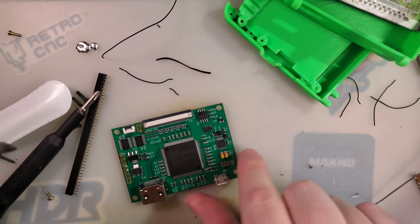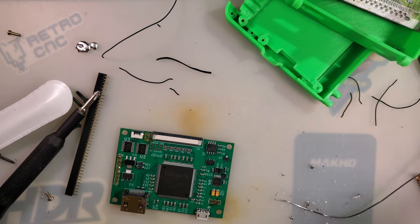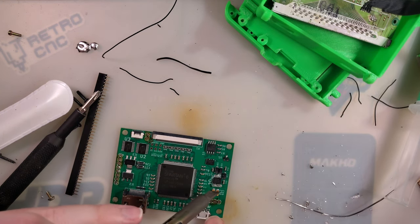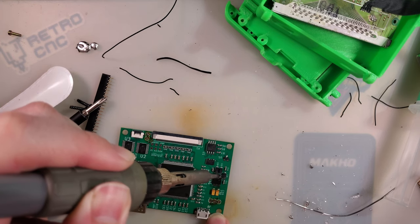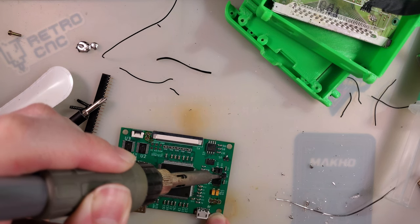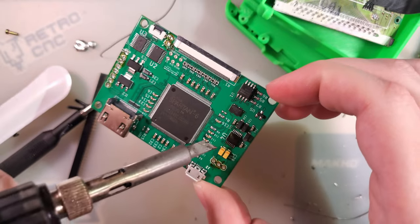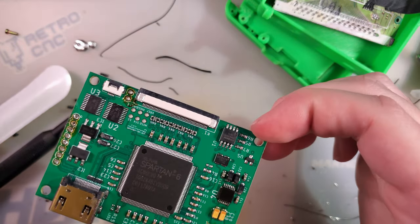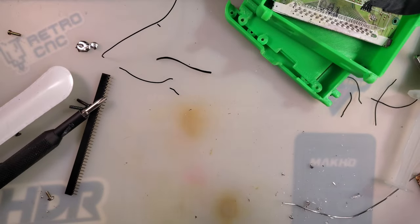And while we're in here, I don't know what's going on, but the solder joints on this component look really suspicious, so I'm gonna fix that while I'm in here. Just load that up with some fresh flux. Yeah, I don't know if that was like a mod or something, but that was real weird. It's all cleaned up now, though. Not the best way to burn off flux, but oh well. Anyway, everything else looks pretty good. Aside from the holes I just cleared out, those things look terrible.